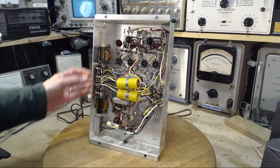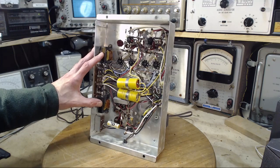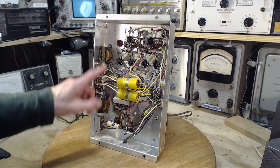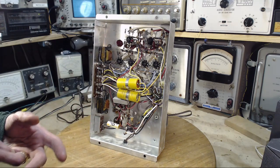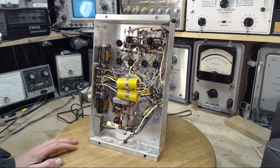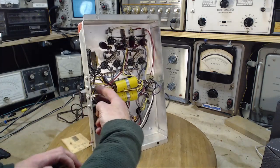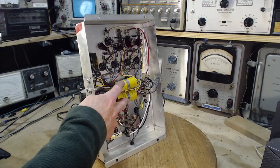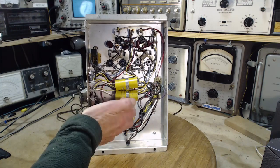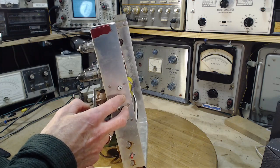Let's start from the output terminals, the speakers here. So assumably, because these are here and these are here, this is a crossover network, arranged by treble, bass, mid-range, or maybe treble, bass, and just neutral, or everything, if you like. And I'd like to figure out which ones would be the everything. So we can see these 2 are getting a feed through the capacitors. So what gets through a capacitor? Higher frequencies. So these 2 would be the trebly ones. That's these 2 here.